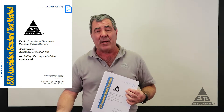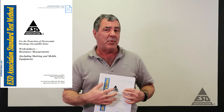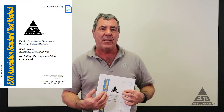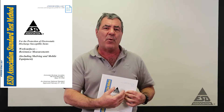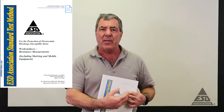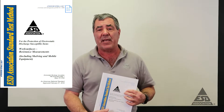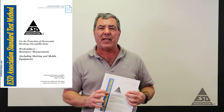The standard also states that the two probes on a stainless steel plate should measure less than 1,000 ohms. This didn't quite make it, but in this case what we're trying to do is ensure we can measure the lower end. Since we're going to be measuring static dissipative mats — which will be much higher than 1,000 ohms — it still gives us a valid test.